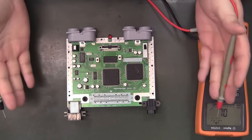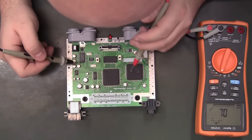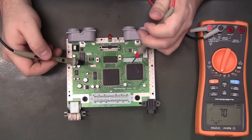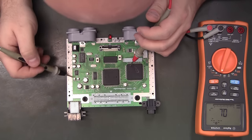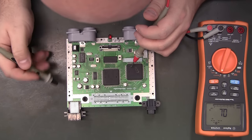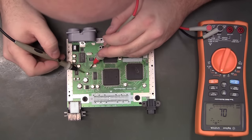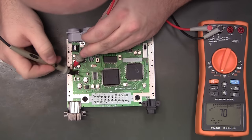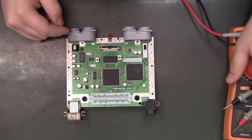On this particular board though too, so I have to take that into account. I'm not sure if I'm going to find a whole lot of boards in my inventory, but from Console 5's website, it looks like there's several revisions, and they all seem to have different counts on the caps too. And that was the other thing, these three caps that I'm not sure of, they do all go to ground. So I wouldn't think it would be that big of a deal if they were ceramic instead of electrolytic.